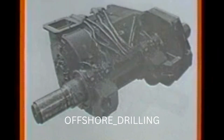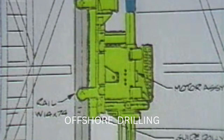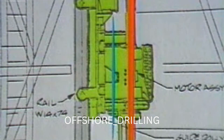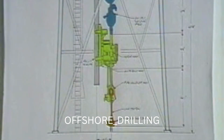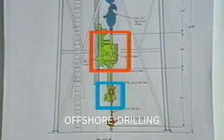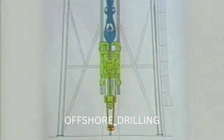The power sub consists of a railway traction motor and gearbox with a shaft replacing the axle and flanged wheel assembly. This widely available unit is mounted on end on a carriage to drive the drill string. The motor is offset from the string, thus no drilling fluid passes through it. The power sub is placed in the overhead string just below the standard swivel. Below the sub extends the pipe handler assembly, a hydraulic torque wrench used to break out connections from the power sub either at the floor or in the derrick. Hanging beneath the pipe handler is a pair of standard Varco links and a drill pipe elevator. The links may be tilted out to reach the mouse hole with a built-in air system to assist the floor crew in picking up or laying down joints in the mouse hole.